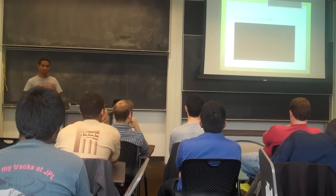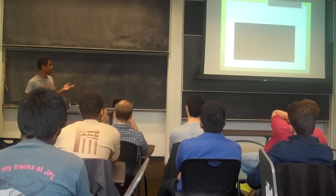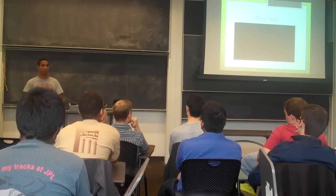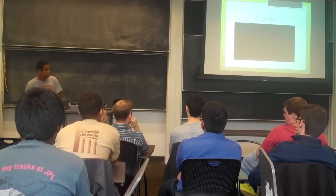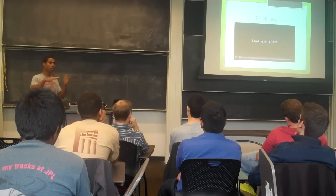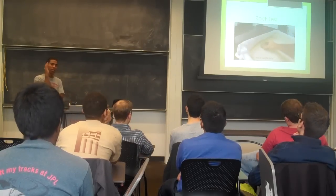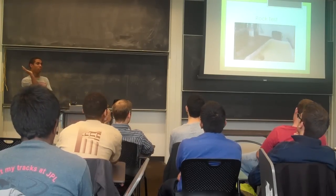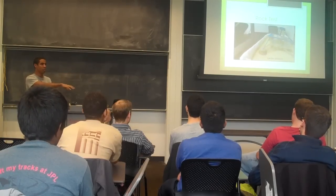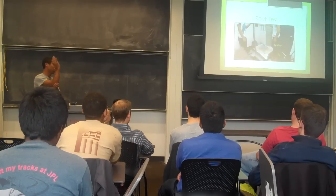So the results we got from this test were as expected, and it proved that our honeycomb inserts were working well. Now the rock test was rather interesting, as we were landing just one leg on a rock, and what ends up happening is the leg that hits the rock first doesn't compress very much, but the leg that's furthest from the rock absorbs most of the energy of impact as it changes the motion to rotational motion and crushes the far leg.